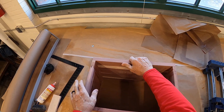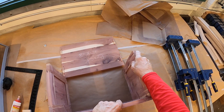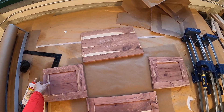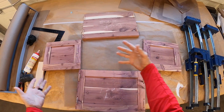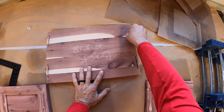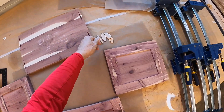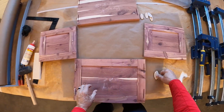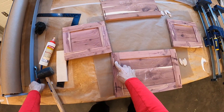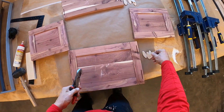I'm going to pull this apart very carefully. Notice all the bottom edges are together — I stand them up. I need to get the biscuits out because we've got to put glue in there. That one's really tight, so I always have pliers ready so I can pull a tight one out.